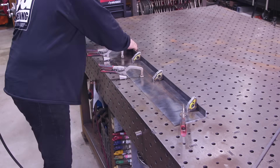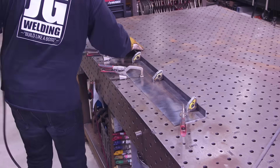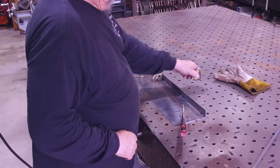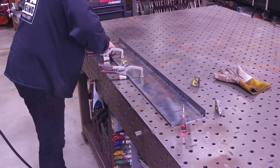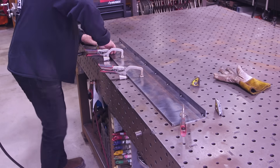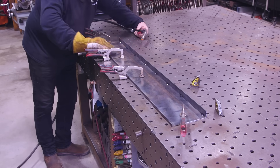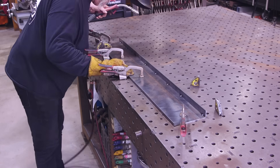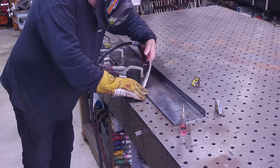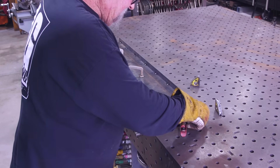It's assembly time. I'm using a couple of mini mag squares — those little magnetic squares from Amazon are really handy. I've got everything securely clamped down to the welding table. I don't want to put a lot of heat into this and cause warping, so I'm just doing some hefty tack welds — nothing structural. This thing isn't supporting any load, so just something to hold it together is all I need. I didn't want to get carried away with big welds on the front.